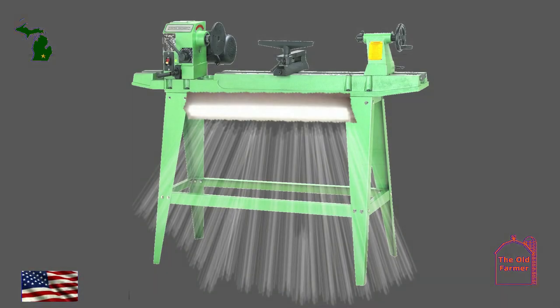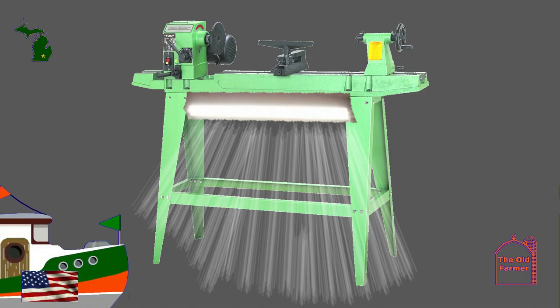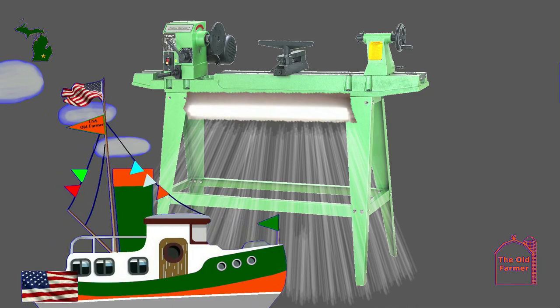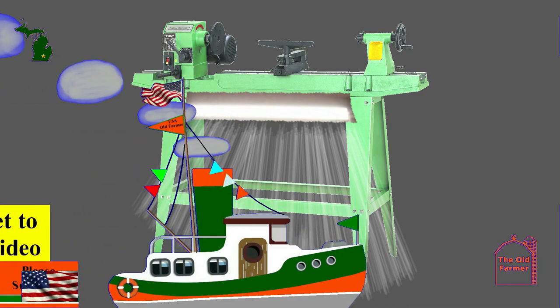And the second thing is a safety light that is very, very obvious and will light up every time the machine is turned on. We won't need the light for something like a miter saw. Once you let go of the handle, the saw stops. But for those things that need a deliberate act to turn off the machine, we should have a safety light bright enough so it can be seen easily without giving us a sunburn.